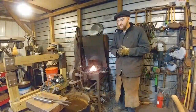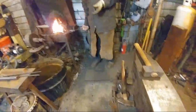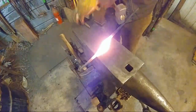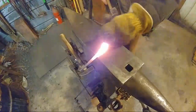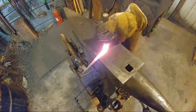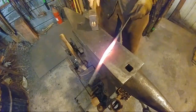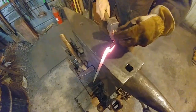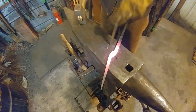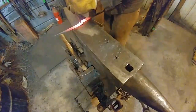So let's go ahead and punch this hole real quick. All right. We're going to go ahead and do one half first, and we'll go over to the other half. We'll do it as well. So come right out here. Punch this right in the center as close as we can get it. Get that down. We're going to aim for that little fading bullseye. Out goes the slug.